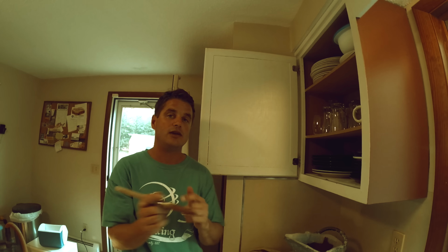Okay, so now I'm going to put this down and take my 4-inch by 1/4-inch nap roller and load it up with a lot of paint. As you can see, I'm going to transfer this to the middle and then slowly work it to the outside to disperse the paint, going up and down. Now I'm going to turn it around and work it into the corner, coming as close to the hinge as possible. Up here, turn it so it's perpendicular, and go across like that.